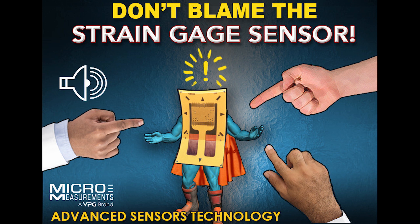Number one — and this is something we really emphasize as we teach customers how to install gauges — is to remove the soldering flux. Whenever you're soldering on the strain gauges, flux is your friend; it's there to help you get the solder to wet to the tabs of the gauge. But as soon as you're done, it's your enemy. The flux is conductive, and what's worse is that it changes with time. If you leave the flux on, it'll create a conductive path to the material that you've got the gauge glued on, and over time, as it absorbs moisture, that conductivity increases and creates a drift in the strain gauges.